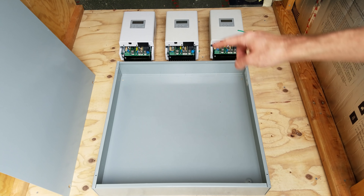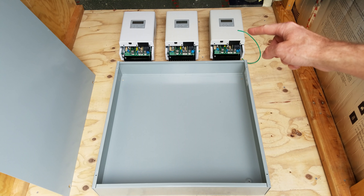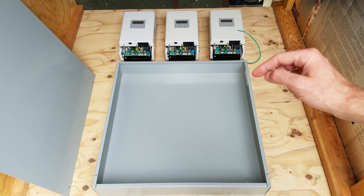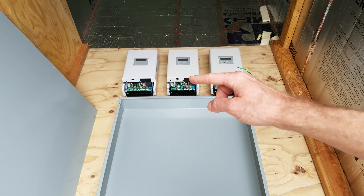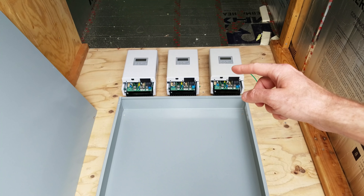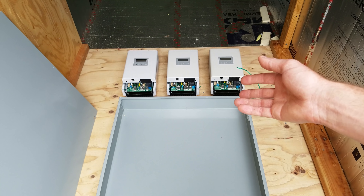The plan for this electrical cabinet is to have the PCM60X charge controllers mounted directly above the cabinet. That will allow me to run a small piece of conduit from the charge controller down into the metal cabinet. The manufacturer's instructions specify I think 8 inches between each controller. However, I had them mounted the same distance apart for about two years and didn't have any problems with cooling whatsoever, so I'm going to go with that same layout for this build.